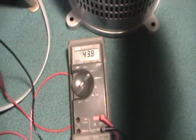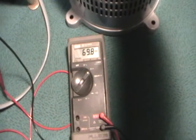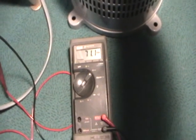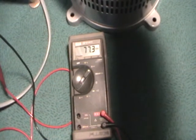By the way, it's this TV here, just for those who may have forgotten about it. Okay, we're on. There's the HT climbing there. About 70 volts at the moment, climbing, so I might just leave it there for now. Put it on about 80 volts and basically see what happens from there.